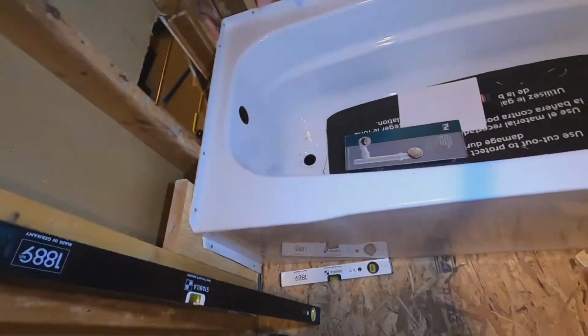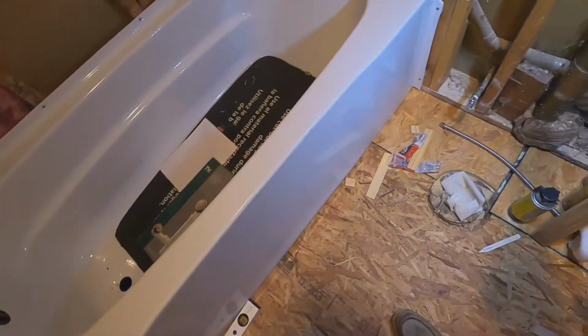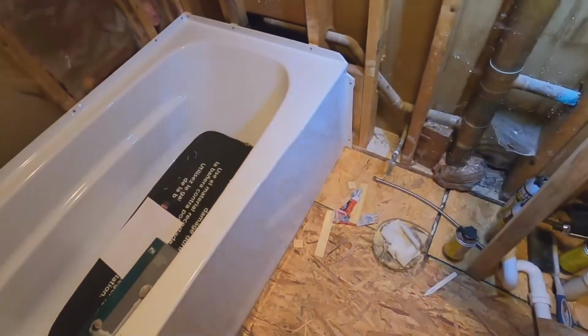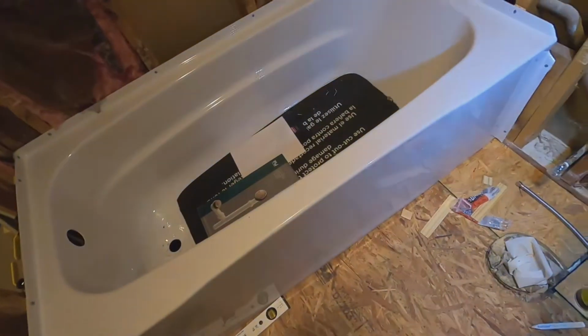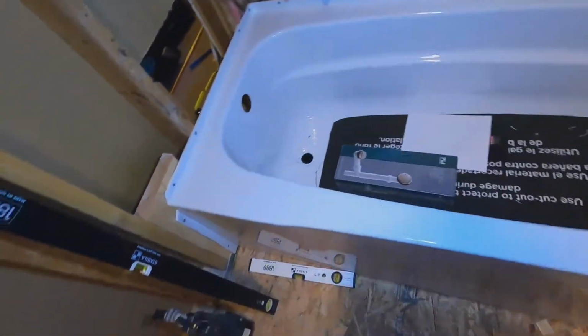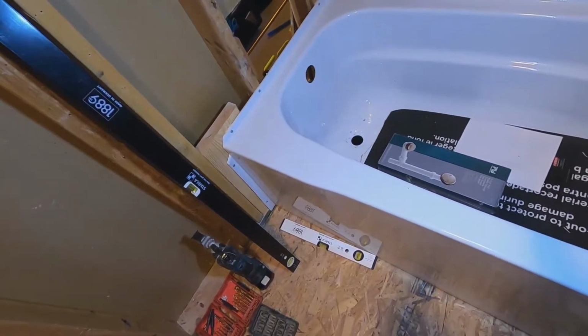And the drain actually runs back to your main vent line here. So I don't have much to replace. Just gonna replace it with 1.5 inch PVC. Give us everything nice and new to secure there.